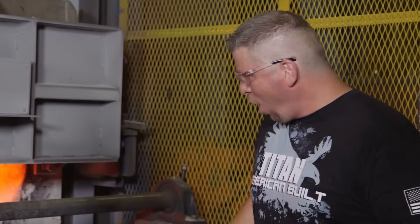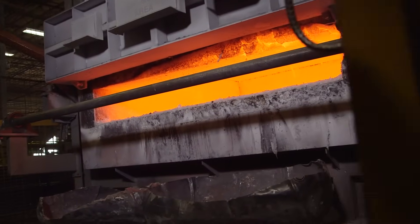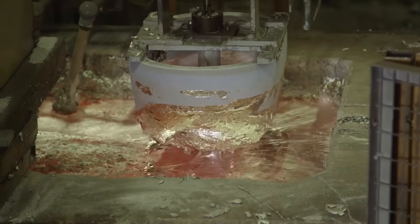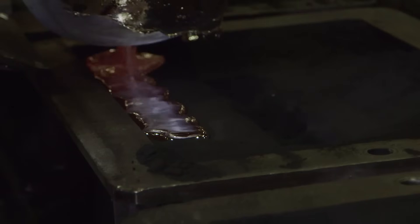After looking at it for a bit, I finally took a piece of copper substrate and laid it in the mold as it would sit if the mold was running in the press, and it became very obvious what happened. Someone had loaded the copper substrate in the mold backwards, so when the mold closed, it smashed the copper substrate into the tool, causing it to destroy the part detail of the core and cavity inserts and causing thousands of dollars in damage.